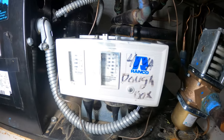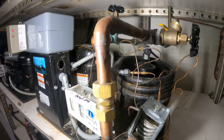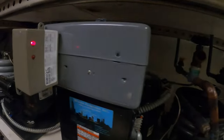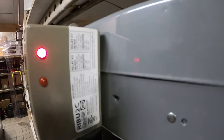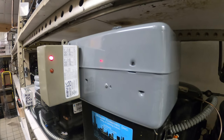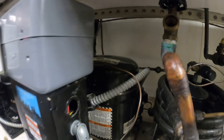This handles the dough for a pizza station, so this is a water-cooled split system. This is our condensing unit. It actually has a rib relay and the top light is lit, which indicates from experience that the thermostat is calling.